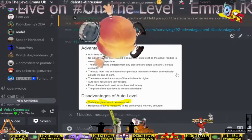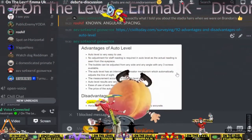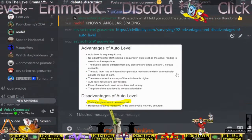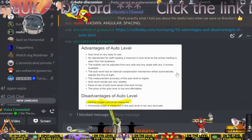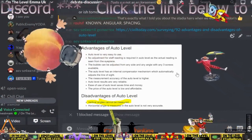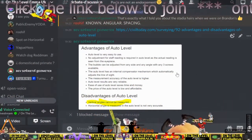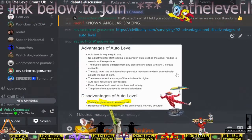Yeah, the stadia hairs are 10 milliradians apart. Therefore, if you have either an actual size or a distance, you can work out the third variable because there is that 3-way relation. How are you working out the angular size or the distance or the size with only one measurement? You're saying you have an actual size, something you measure on the rod. A measuring rod, yes. You have a measuring rod, and they have known sizes on them.